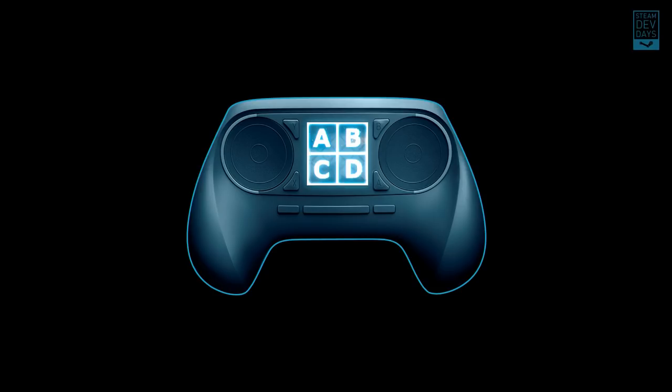Touchscreens are a great solution when you have finite space but need to represent many keys or trays of keys. We started playing with placement, layout, size, different display types — LCD for view angles versus OLED — battery draw, and processing requirements. Touchscreens worked: you could get from any standard key to F-keys or numpad keys while holding the controller. We could also bury subkeys that you didn't need all the time — for instance, if a game uses the End key for night vision only twice in the entire game, we could bury it one or two trays deep inside the touchscreen.